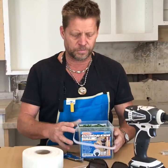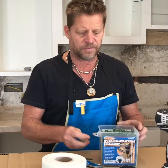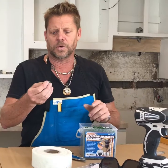This is a really important item right here — your backer board screw. There are some important features of it. First of all, it's a premium alloy, meaning it's not a recycled metal. The recycled metal, when you go to screw it in, it twists off. So, real important.